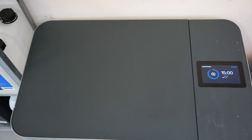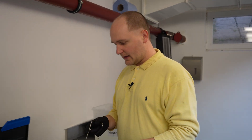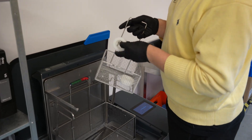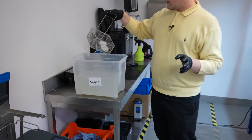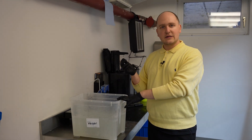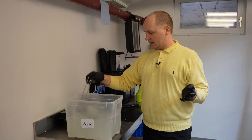The parts are washed. Since we're washing with TPM, there's one extra step you don't have if washing with isopropyl alcohol. I take the parts out - you can check if there are any small specks of resin left, and these look perfectly washed. Now they go into normal tap water. When washing with TPM there's a slightly soapy film on the part that needs to be removed, so the parts just need to sit in there for a minute.